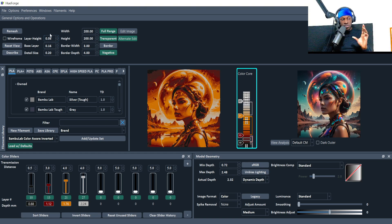You've got options for width, height, and layer height. You can do 0.08mm which is standard, or even go down to 0.04mm. NeoKoi, who creates a lot of HueForge tutorials, told me you can do 0.04mm on a 0.4mm nozzle, which is awesome. Base height is just your first layer height. I've raised the thickness from 0.48 to 0.72 to make it a bit thicker.